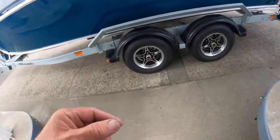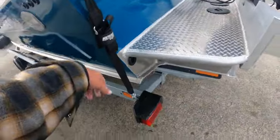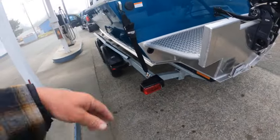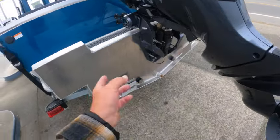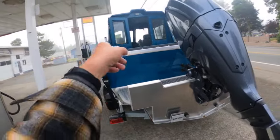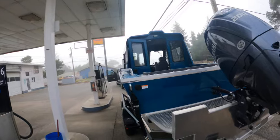Gear bath — hub oil: brown is good, white is bad. You've got your bilge pumps right here, overflow. That must be for the macerator right there for the fish box in the center. Your gas fill is there, you've got zinc bars here — two of them; typically the worst one is down. You've got a washdown which it does in the back, drains on the back too — that's a good deal. Welded-on brackets, rod holders on the side, rear deck light, bulkhead door.